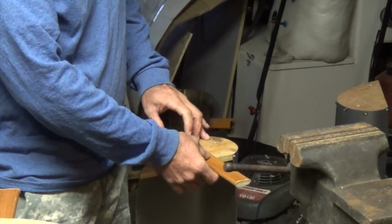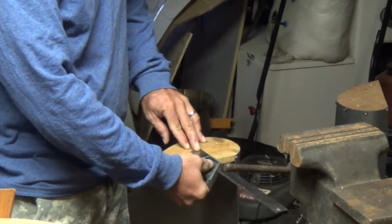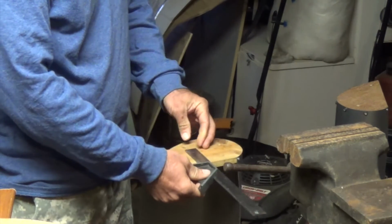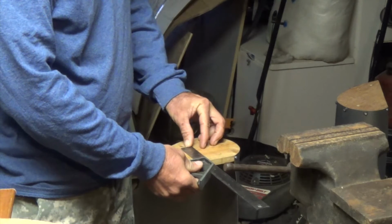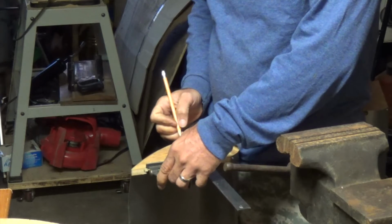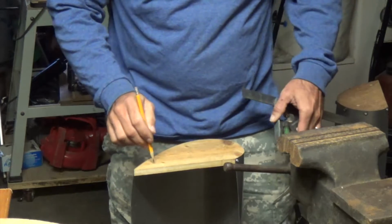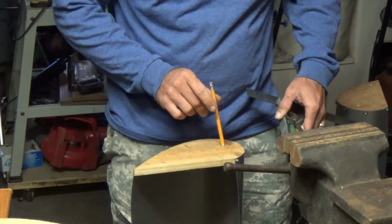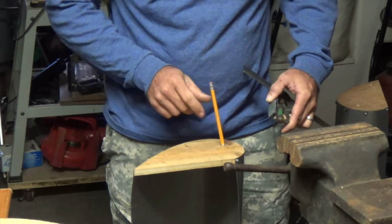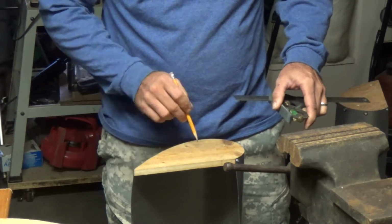I think somewhere around here would be ideal. So just to make sure I get in the same place for each of them, I'll use this to measure to where I need it to go. Kind of hard to do because this thing is moving, but keep it on the flat side here. Go ahead and draw my line. Since all of these holes are in the same places on each part, I can just measure off of these holes, probably this one. That way I get my point of reference for where I'm going to actually drill this hole through.